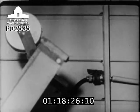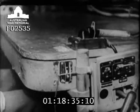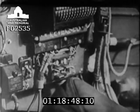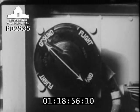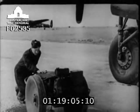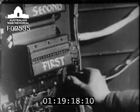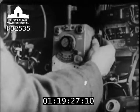The precautions about to be demonstrated. Here is the five-pin plug being removed from the flare chute. This would normally have been carried out prior to commencing any loading operations, together with the testing of the bomb release circuit. The safety switch on the navigator's table is set to off, and the main fuse in the release circuit removed. The ground/flight switch is set to ground. The starter trolley is disconnected to ensure that the electrical circuit is not energized. See that the jettison bars are at safe, and that all selector switches are off. Fusing switches off, and the bomb firing switch stowed. The T-35 camera and photo flash control mechanism is disconnected as a final precaution to prevent accidental release of the photo flash.